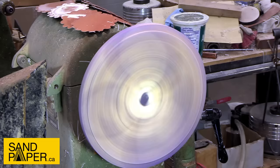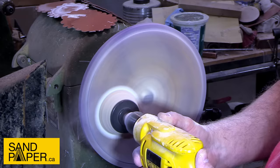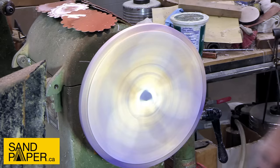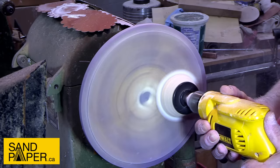Once I got the size I wanted, it was sanded from 60 to 800 just like the bowl was. I typically don't see the need to go any higher than 800 on these pieces, especially if we're going to use a triple-E buffing compound to buff it after the 800. I'm just roughly sizing the rim to the bowl - not the exact size yet, but pretty close.